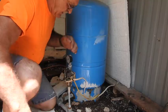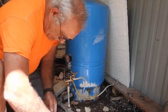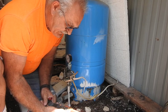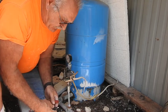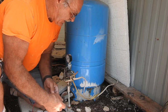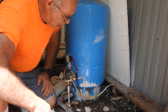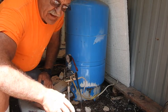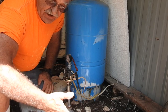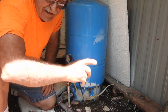So let's verify we have the right terminals and pull the two yellow wires off. Now there's something about this test you've got to know: if your overload is open, it's going to read no continuity, because the overload is common to both the start winding and the run winding of the motor. I'm attaching the meter now, and I actually have zero continuity. So one of two things: either the overload is open and overheated — which means it should reset quickly since it's submerged in cold water — or we can check for continuity through the windings themselves.